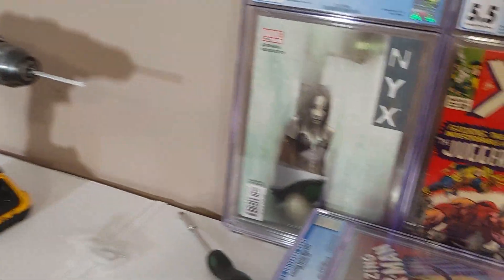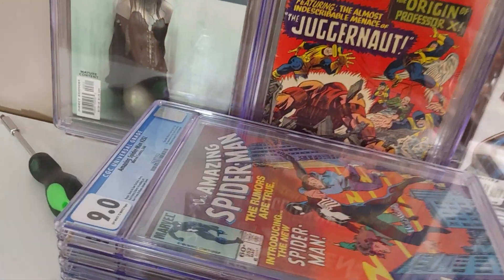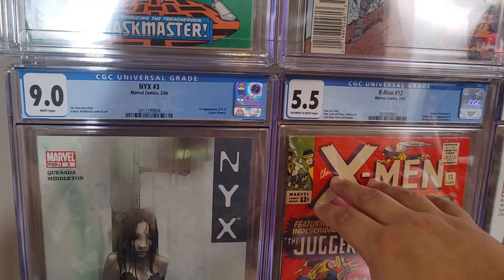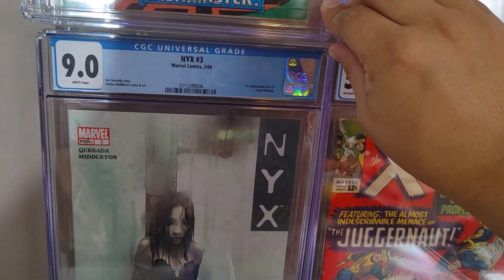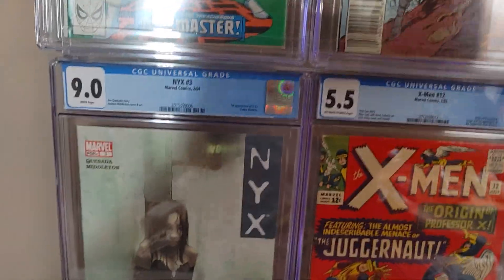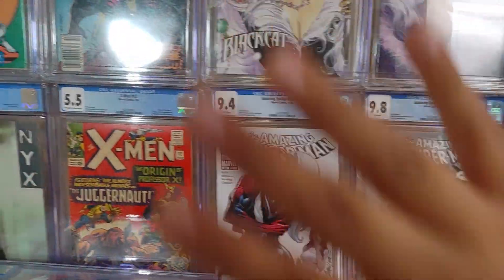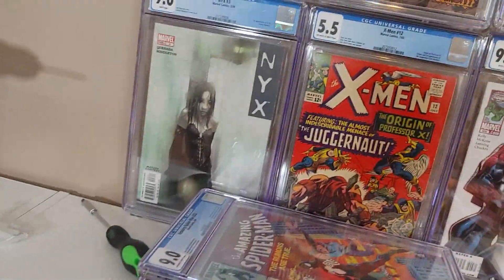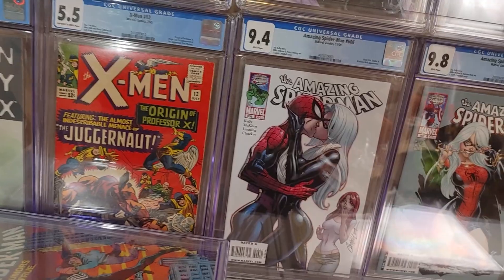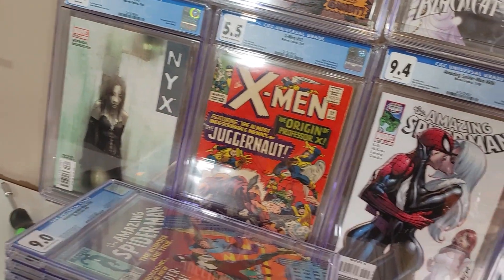The last thing you'll need on standby is some slabs — this is an important part of the measuring process. I put a shelf on the wall, then put a slab up there and set the next shelf on top of those slabs to use as a measuring reference, so I know exactly where to put the holes for the next row. As I went along I kept trying different processes and this is what I found to be most effective.